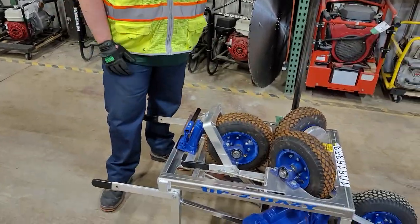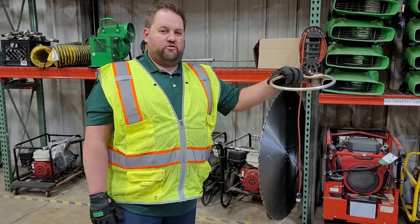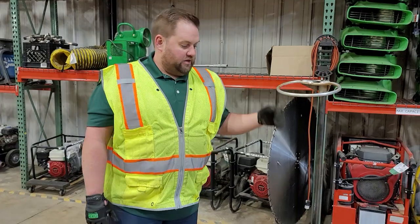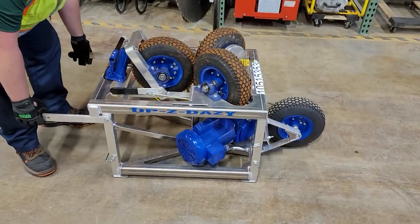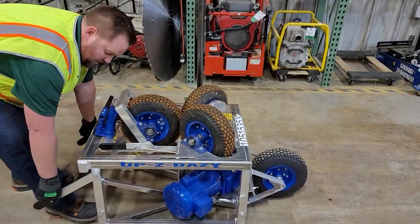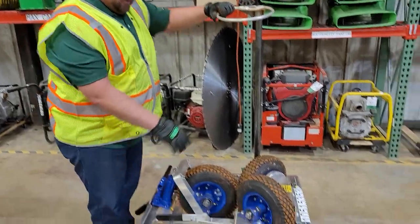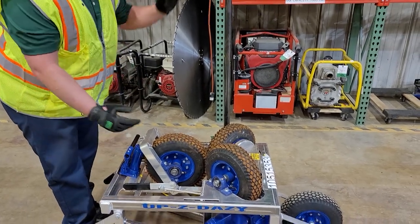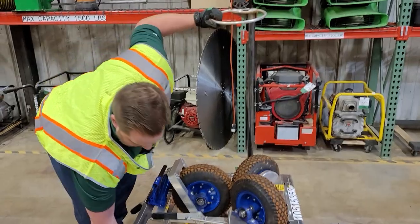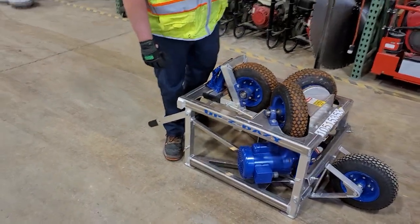This is the Upsy Daisy Model 30 Well Pump Puller. It weighs about 155 pounds, so if two people need to lift it, it's definitely not a one-person operation. It does have a wheelbarrow style setup, so it's easy to transport. These handles fold away. So the first thing you do when you get to the well is you want to center the machine over the well. You'd actually bring it around and then back it over the well cap. It has legs that are adjustable, so if you're on an uneven surface, you can adjust that out.